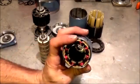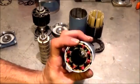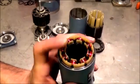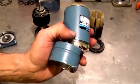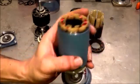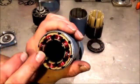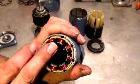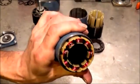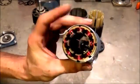With a stepper motor it's going to be very difficult to press all that out, so what I did is cut all the wire across the faces. You have to chip out all the plastic, cut all the wires on both sides — you can see the other side has all these wires hanging out of it. Cut all the copper wire off those coils, then take a press something about the exact same size to fit against the laminate ring inside the case. Press that out really gently, try not to hurt as many as you can.